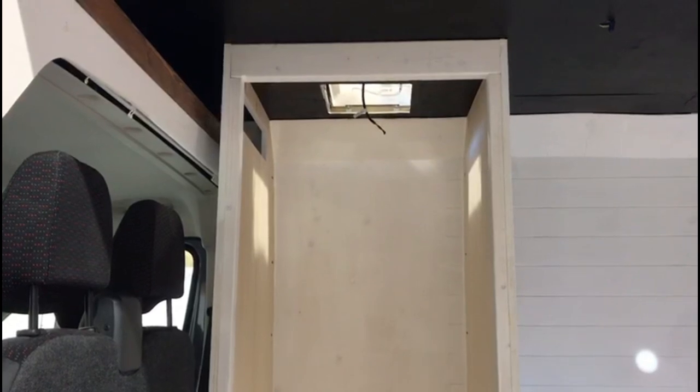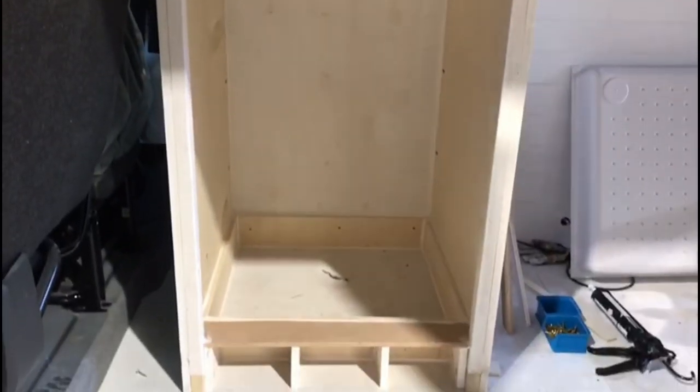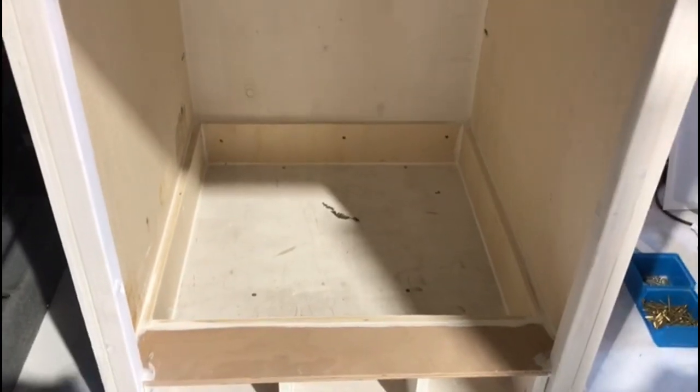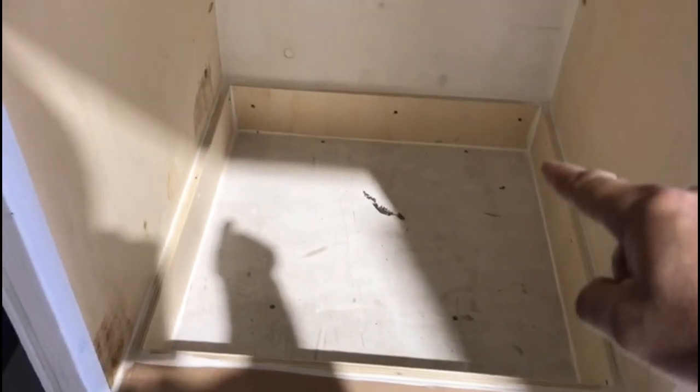We've got the horizontal piece at the top of the door lining, and further down the line this end grain will get covered with a piece of 45mm architrave, giving a nice border of about 5mm before the architrave takes it up flush. At the bottom of the shower cubicle we've been building the tray surround — again using 18mm plywood for the tray supports, screwed and glued into the side walls, with sealant run all the way along the edges to create waterproofness.